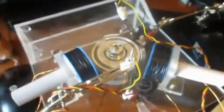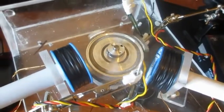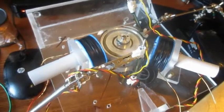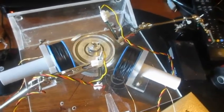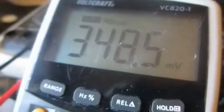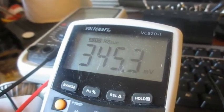It won't run very long on this, but you can check it — it's quite slow but still turning. That is quite impressive. Of course the supercap is discharging much faster than the 2600 milliamp-hour 1.5 volt battery. But I can charge it up. Now we're turning at 350 millivolts — it's in the millivolt range, going down slowly but surely.